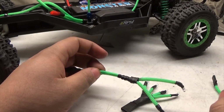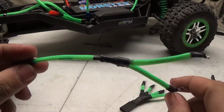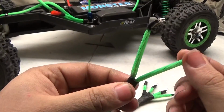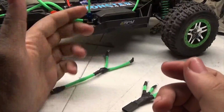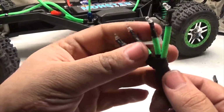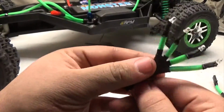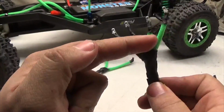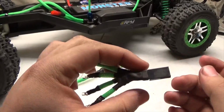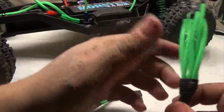Alright guys, so now I have each segment done, and let's take them out. First off we have the rear. These two are red LEDs. We have the line coming from the main line into this little part where the resistors are, and it comes out and goes into these. Very basic, very simple, it's small. We got the front one right here, which is about twice the size of that one, with 4 resistors and 4 LEDs. This is going to be mounted in the front, kind of at an angle, if you can see, with this one being so much longer than everything else. It's going to be seen at a slight angle. That's just the way it set itself up while I was working on it. It should work still.